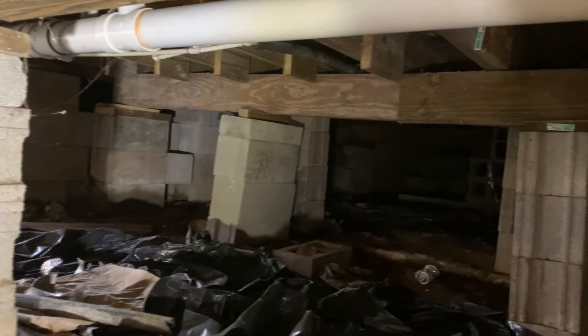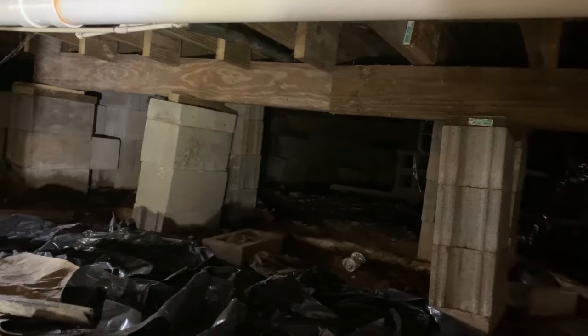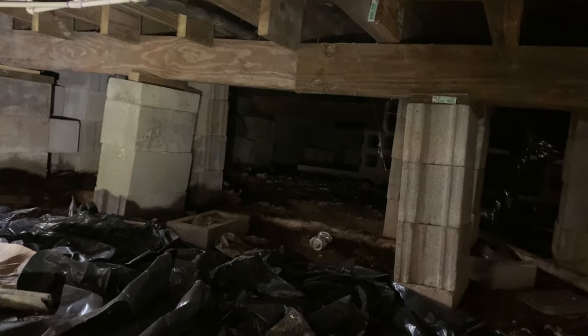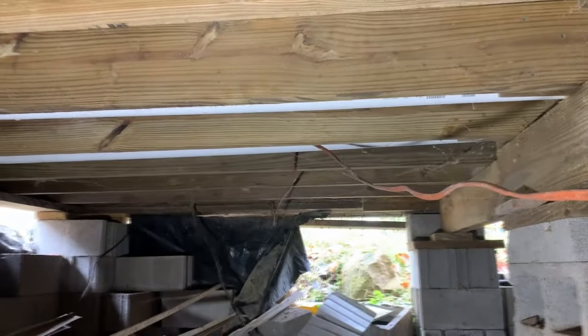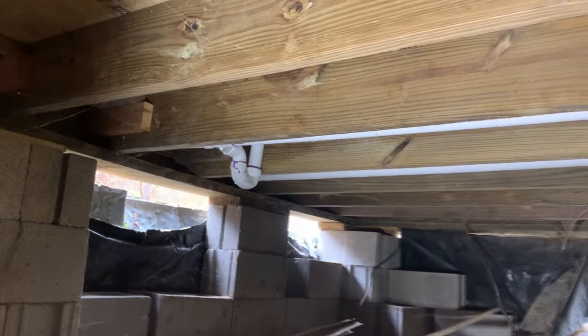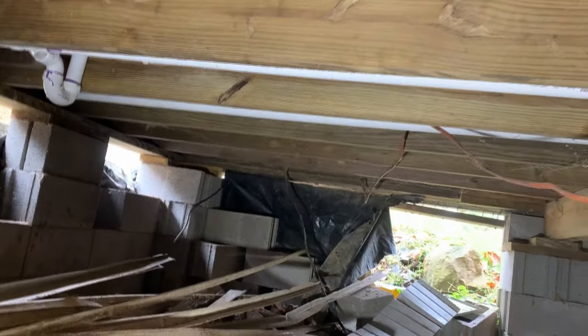Back here you can see more piping — the main three-inch stack line, or actually the sewer line. And then beyond it there's another girder beam that sits underneath a load-bearing wall. Beyond that, about two feet, is actually the center of the house. What we did is take all of the joists out of this area and started from scratch, using a pair of 20-ton bottle jacks, lifting things up little by little and putting things back in place with a sledgehammer.